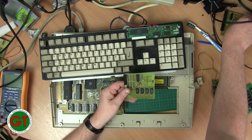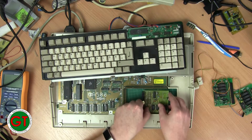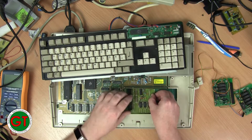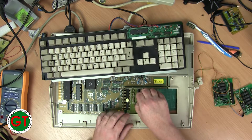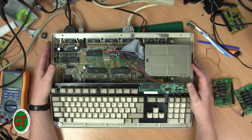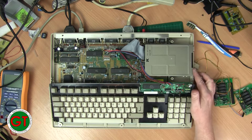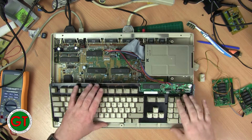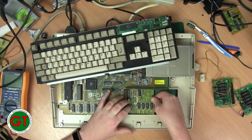Let's try this one. I have little faith in this one working because it was so badly corroded compared to the others — but we'll give her a go, she might surprise us. It was tricky to get these boards in sometimes, getting the pins lined up. The Amiga's booting, which is a good start. Again, battery backup clock not found, and no extra RAM either. So that board is completely dead at the moment — we'll have to investigate that one further. This one's going to need more in-depth repair, which I'll probably do in another video.